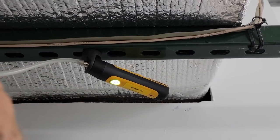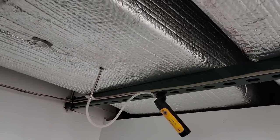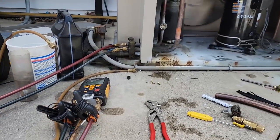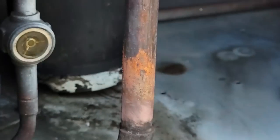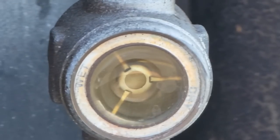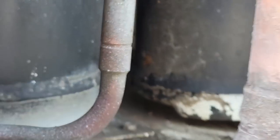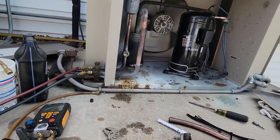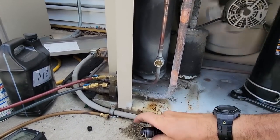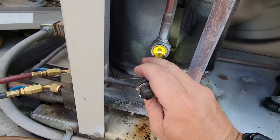Our static on just the return was 0.281, or 0.16 on the supply. So we're definitely hurting more on return than we are on the other — but that could be from sharp bends and things like that. But the total, we're not doing too horribly bad. Jumping back out to here — so we've got 15 pounds 10 ounces in it so far. We're still not looking full yet, which according to what I had on that chart it shouldn't be yet. So we're still kind of getting that in there yet. Trying to do 50 things at once.